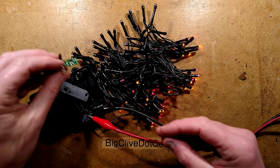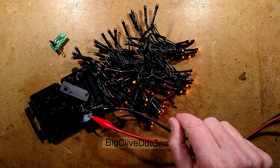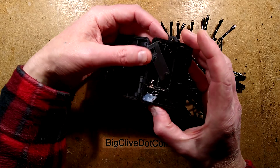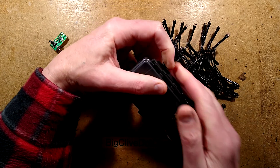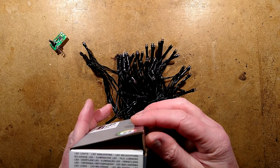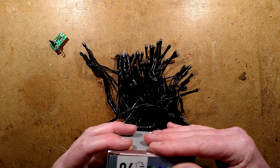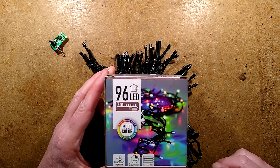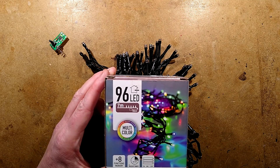I'm going to have to devise a little circuit that simply does H-bridge drive with self-feedback, so you can actually drive a string of these without their dedicated controller, because it's annoying with the built-in features. But there we go — that is the current state of play with the Christmas lights. I'm getting a slight deja vu; it makes me wonder if I've taken a very similar one apart. But at that cost it's actually worth getting just for things like the case, because that's a fairly good little waterproof case. It looks pretty robust — it really snugs that seal down, you click it shut. This year's batch of lights — it's got tons of text on it, self-import agencies. They do various multiples of these sets; above a certain number they switch to using a plug-in power supply, but below that — 48 or 96 — they do the battery-operated ones. It's a nice enough little set of lights.